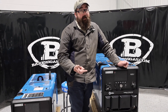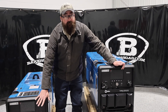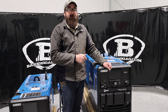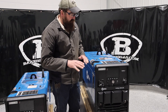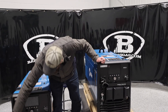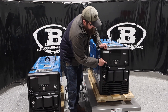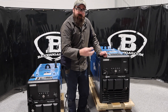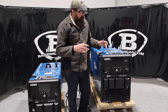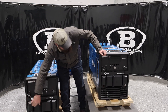The 330 has pulse TIG, adjustable inductance on the wire feeder, and arc reach — where the 265 does not. So if you already have an arc reach feeder and want to run it with arc reach technology, you need the 330, because all 330s come standard with arc reach. The 330 also has a 14-pin connection for remotes, wireless foot pedals, or wireless TIG finger control, and amperage remote. The 265 does not have a 14-pin but does have a direct connect for the spool gun.